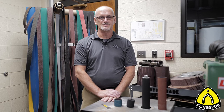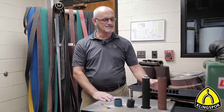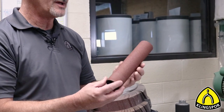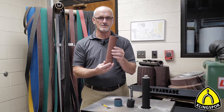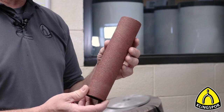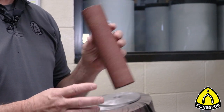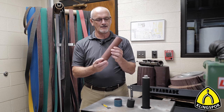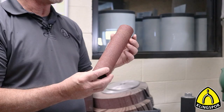Not all sleeves are created equal. We see a lot of confusion in the market between different kinds of sleeves. The one I'm referring to here we call a no-lap band — also called a spiral band or sanding sleeve — and you can see where the confusion comes in between a sanding sleeve and a pump sleeve. The difference is that this sleeve has abrasive affixed onto a hard cardboard tube.